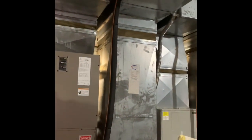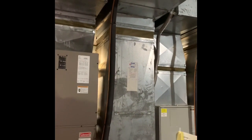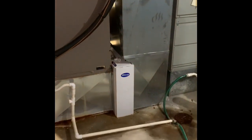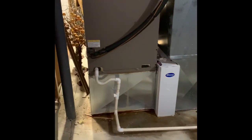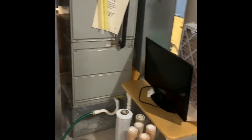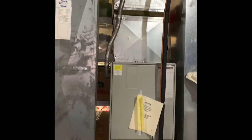This one over here has got mold growing on it, so we'll rework the ductwork up to a certain point — probably end up taking it to where everything drops down. New media, new box. Drains are all here. That unit hasn't worked in a couple years, so they're debating on what to do with that one.